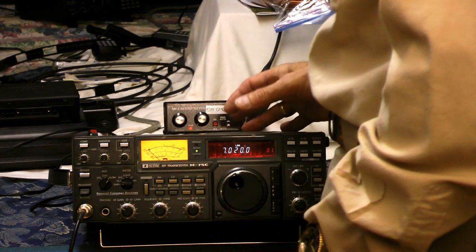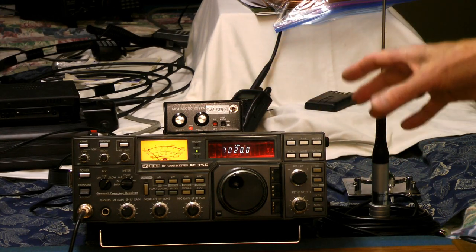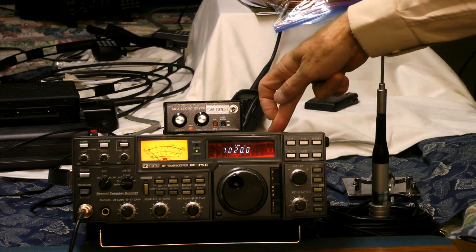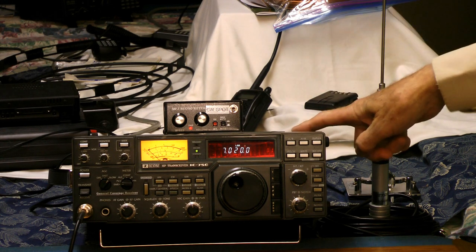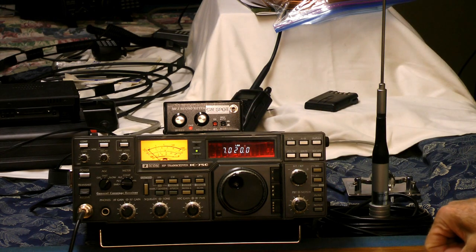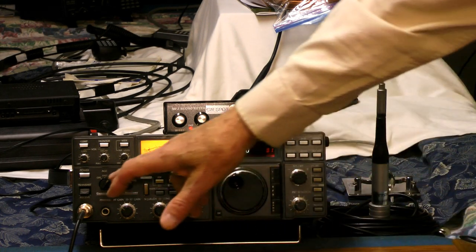In the old days, to make sure you weren't transmitting outside a ham frequency, you had to pass a test showing you knew how to calibrate the transmitter. You'd tune the receiver to WWV, WWVH, or CHU at 15 MHz, right on the money after warm-up. There's a crystal oscillator built in here, and you calibrate it to zero-beat WWV. Once you know the crystal calibrator is good, you adjust the receiver to match, then adjust the transmitter — and you can hear yourself back in the receiver to confirm. Modern sets are so accurate they don't need this at all.